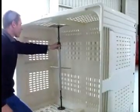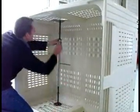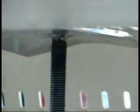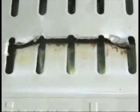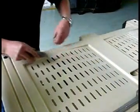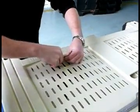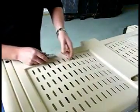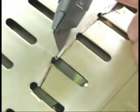The first step in repairing the bin is to support the damaged area with a jig. Get the pieces to align as close as possible to the original shape. By using a carpet knife, trim away the excess plastic to ensure proper alignment of the damaged parts. When alignment of the parts is as close as possible, taper the two sides where welding needs to occur. This ensures a bigger surface area for the welding rod to blend in with the plastic.